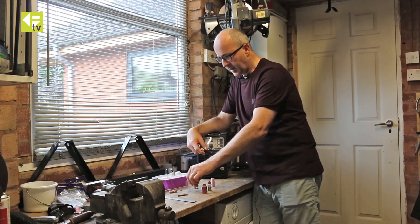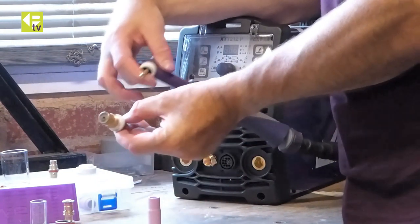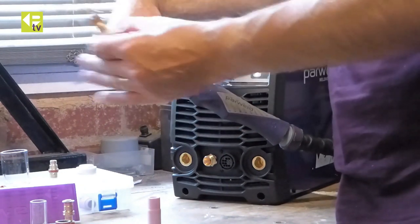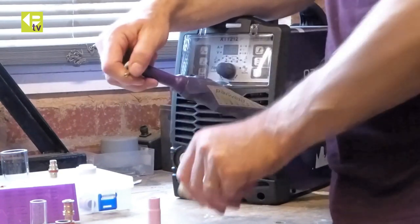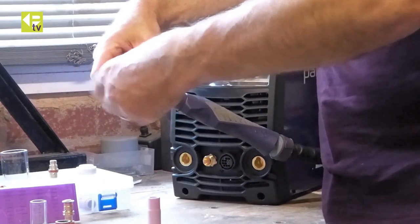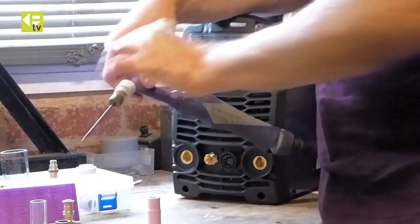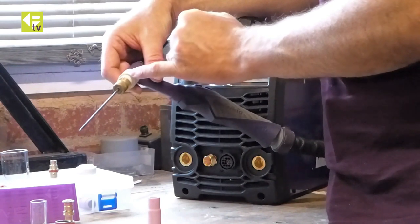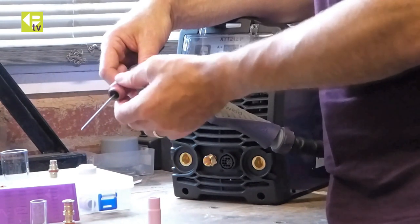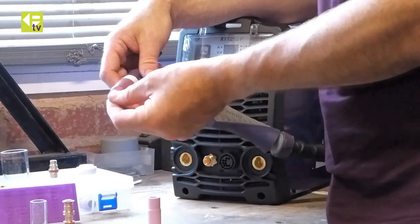The third setup you can use is a traditional gas lens. Where the gas saver has a relatively small area, the gas lens itself has a much larger area where the gas comes through the mesh gauzes, with more of them stacked together. This improves the laminar flow of the gas so it tends to come out of the torch much smoother. The disadvantage of the gas lens is it creates some bulk on the front of the torch. Just screwing this on — with the P26 there's an extra washer we need to put on as a heat seal. You can see this extra bulk at the back; the front end tapers down to different nozzle diameters but you've got some extra bulk there which may cause issues depending on what you're doing.